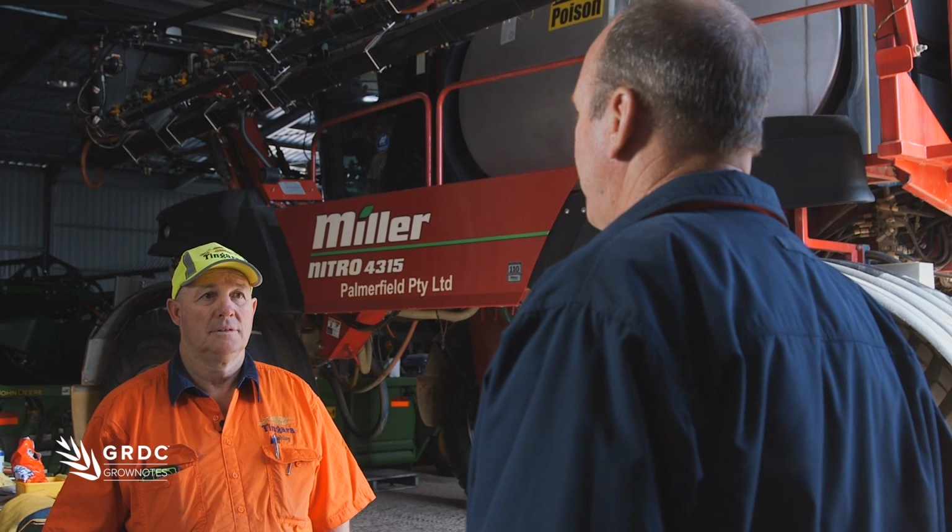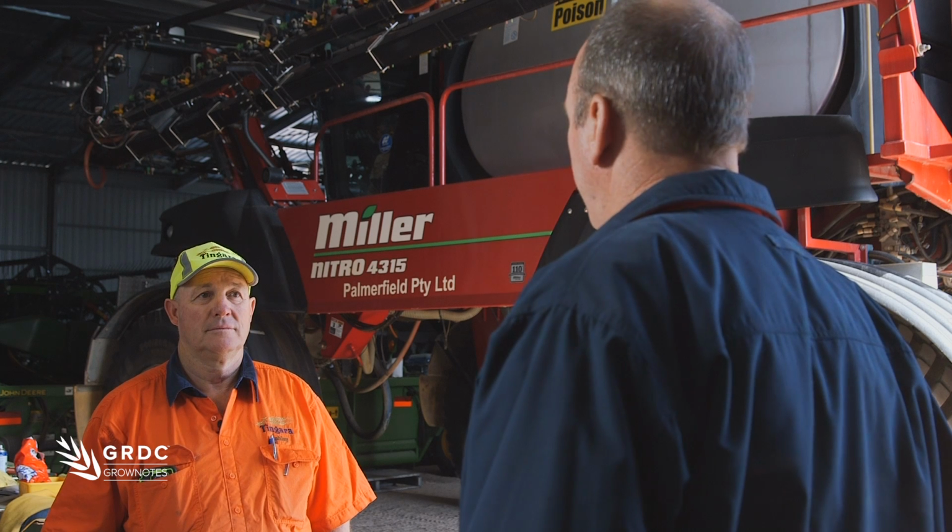How did you find out what the issue was with the shape of the tyre being a little bit bulgy for two tyres and standing up better on the other two? What did you find there? Just by chance, we weighed the front and the back on the dual pads, and then we decided we would weigh them individually, and found there was a huge discrepancy in the weight between side-by-side tyres, front and rear, anything up to 2 to 3 tonne.